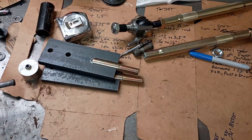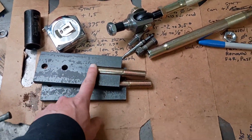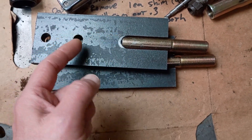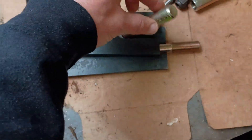Mystery Cheap Shop here. Today I'm about ready to weld these parts together for the thrust rods on the Falcon. You can see everything turned out pretty good. I ended up not using that. That's a good fit. That's where I milled a little far, but it was only 20 thousandths down, so no problem. The weld will cover that completely up. So I'm ready to weld this.